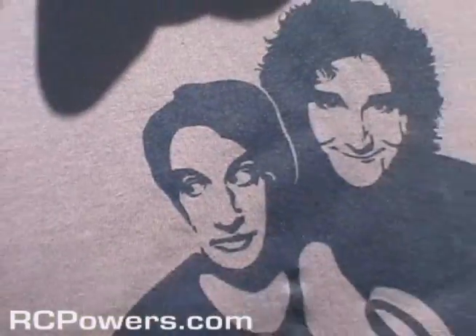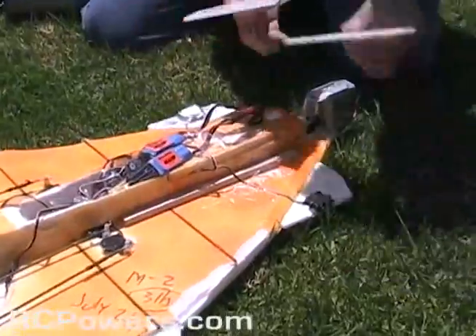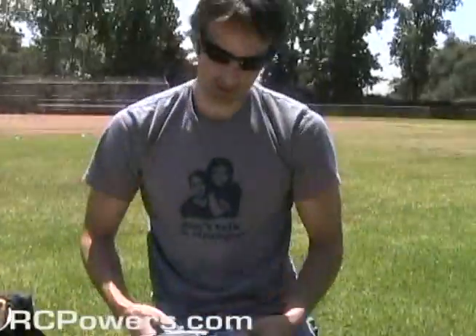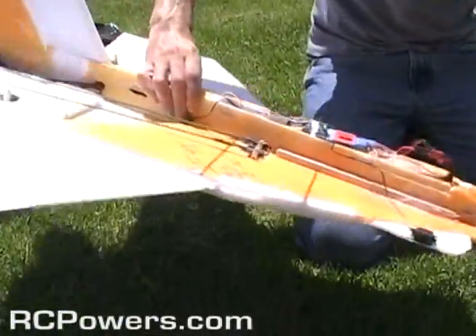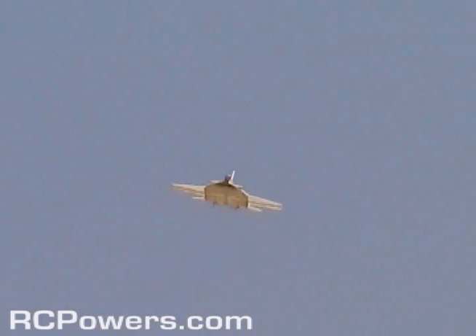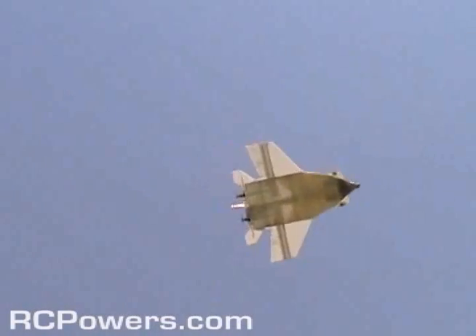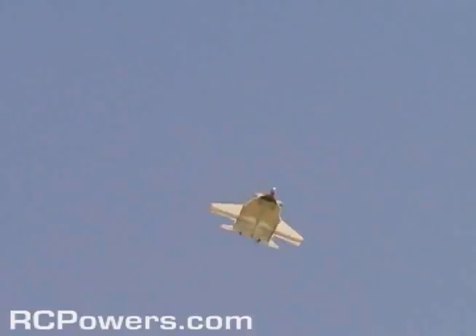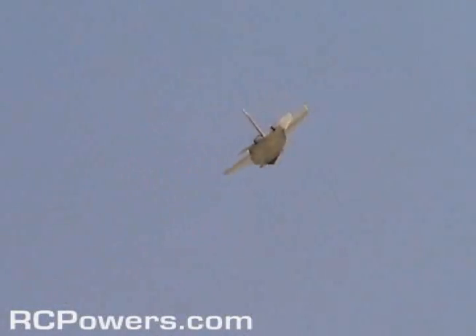Let's try it without the canards. I'm going to take off the canards and see how that works now. Since I was getting too much lift in the front because I took the wingtips off, now I'm taking off some lift from the nose, and that should balance it out. Now I basically have an SU-27. It seems faster — yeah, those canards in the front of an airplane produce a lot of drag that then runs along the rest of the airplane. So on the next plane I'm going to make the canards pretty small — find the right ratio of having them do what I want without being any bigger than they have to be, because they have a pretty heavy side effect of drag. It's harder to keep the nose up without those canards when I do the high alpha, because once my nose starts to drop and stall out I don't have the canards there to lift me back up.